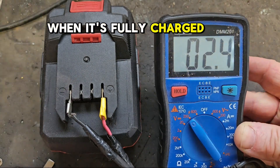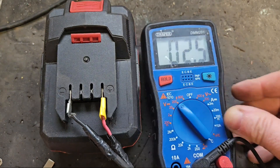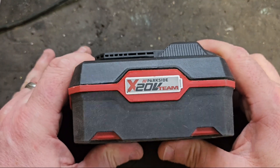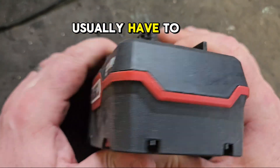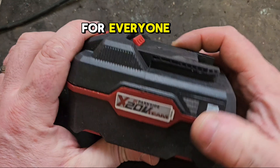That's a 20-volt battery and it's supposed to be fully charged, so 2.4 volts is not great. When you have a battery showing a very low voltage like that, you usually have to bring the voltage up somehow, and the jump-start method is usually the go-to for everyone.